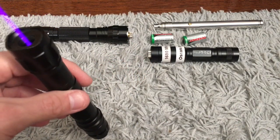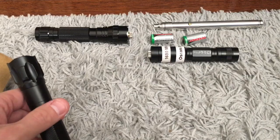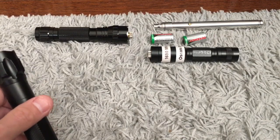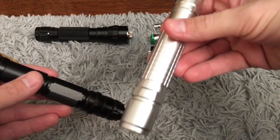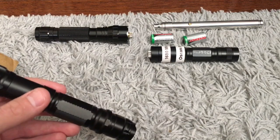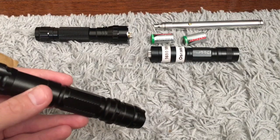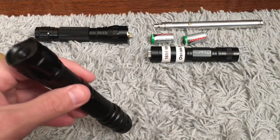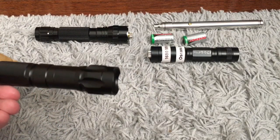I've tested this thing on the meter — I'm going to tell you the results. It's quite interesting because I found that all of my purple lasers are like this: my Skylasers pin, my Skylasers 80 milliwatt pin, my BDR-209 16x laser build, along with a couple of other violet lasers I've had. I noticed that these things — I guess it's because violet is what it is, usually used in Blu-ray players — are incredibly stable. I hit this thing on the meter and it shot up to about 70, 72 milliwatts pretty quickly and never really stopped.